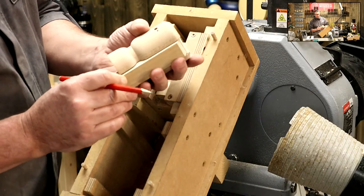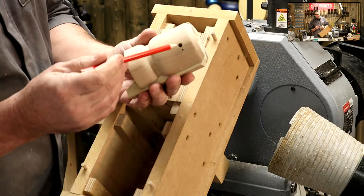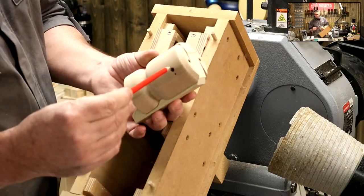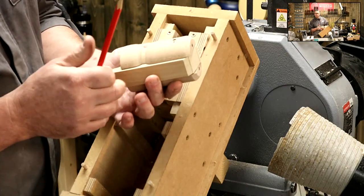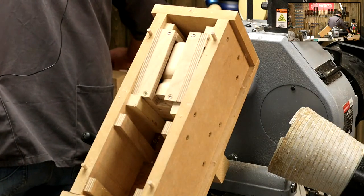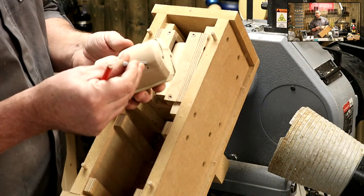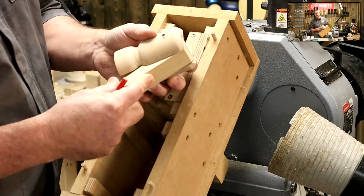Again, we've already got the hole here. Once I've drilled this, and this hole is a through hole, it comes right the way through both sides, and once you've got the mechanism inserted, you drill all the way through to your other hole. Then you've got your position for your pin to go through. It's up to you. You can use a bit of dowel, or you can get yourself a bit of silver steel and pop that through. That'll keep everything in place and create your mechanism.